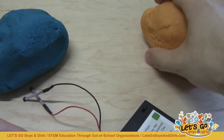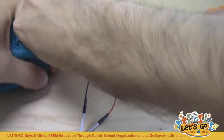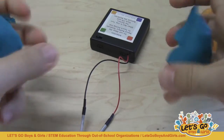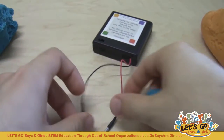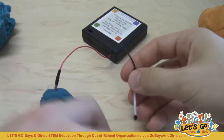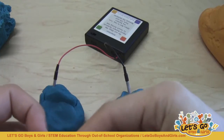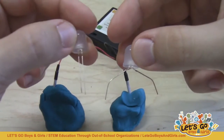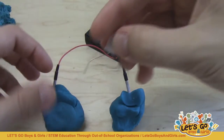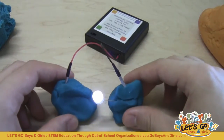You can have them make their first circuit where they take a battery pack and two small lumps of conductive dough. I'm going to do this in real time here — I'm just going to take my two pieces of conductive dough, insert leads from the battery pack, and spread the leads on one of the LEDs out. You can see they come in the package like this, but this is much easier to do if you spread the leads out. Just stick the LED into the lumps of conductive dough.